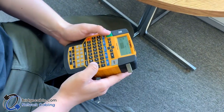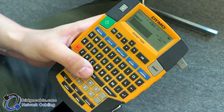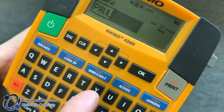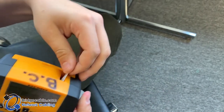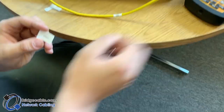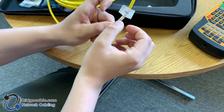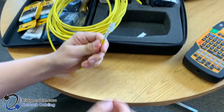Now Jimmy is going to do a cable flag. Since we're still on the wrap settings, just hit clear, hit OK, and you're back to the standard settings. Let's call this cable PAW — type in PAW, that cable is faulty. Make sure you're on the correct size; we're on 50, so we'll change it down to 12. Note that the text is vertical on the flag. You'd put it somewhere in the middle of the cable and fold the two ends to the back — and that's what it looks like.